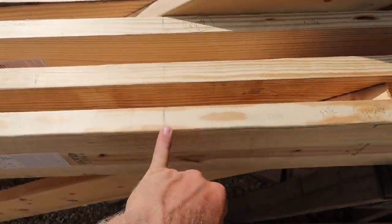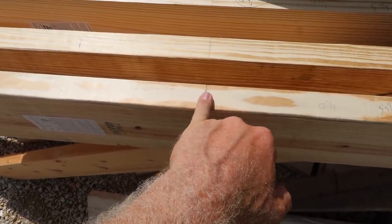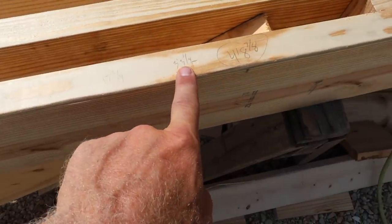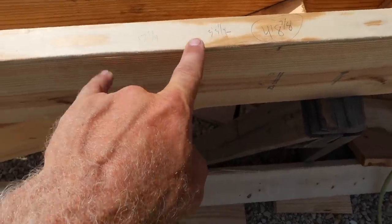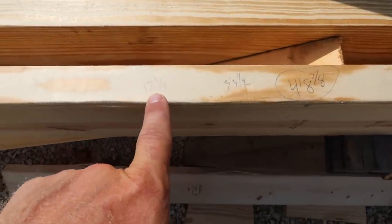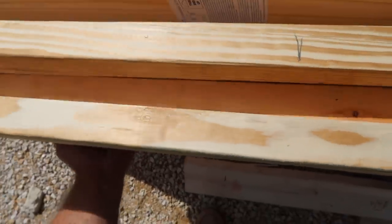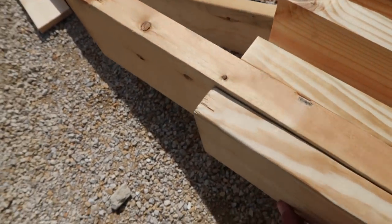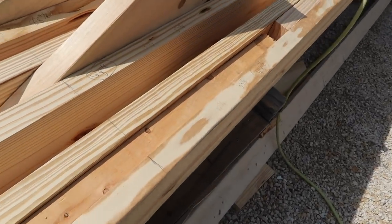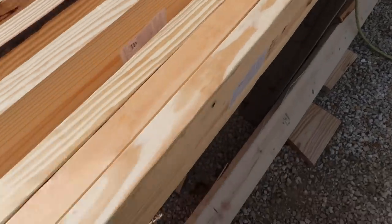What we've done is I've got my heel marked, and I use that to determine the height to the top of my truss. So I know I've got a 15.5-inch heel, and at this post I'm going to have 3 3/8 inch rise. So I've taken the dimension between the heel and my pocket, which is 17 3/4, I've added 3 3/8, and I come up with 21 1/8. Then I cut a 2x8 in this case because my columns are 2x8, and I'll put this in the middle ply of the post. Obviously that's not where it's going to go. And then I'll fasten that off.